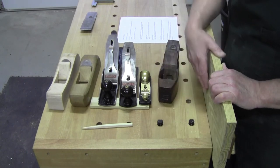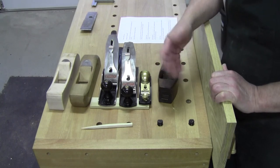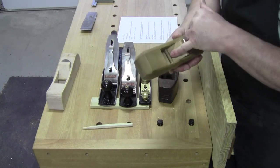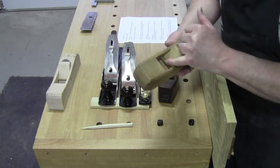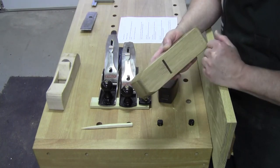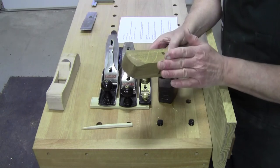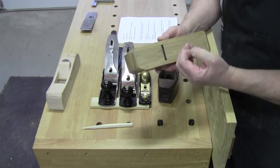Then it became tradition. My workbench is made of European beech that has been steamed — they found that steaming it and then drying it makes it more stable. But you can make a plane out of anything. This plane is made of white oak for the cheeks, white oak for the pin, maple for the center body. This is a Krenov style plane. I have hard rock maple for the body and then I laminated on a piece of white oak to the sole for durability — and it was a test. I love this plane. I don't think white oak was the best choice for the sole. Cheeks is fine, but for the sole it should be a tight grained wood — something like beech, something like birch, something like hard maple.